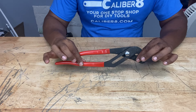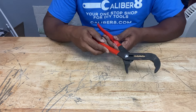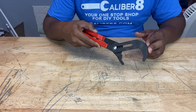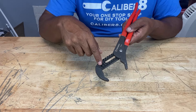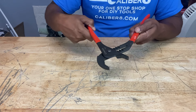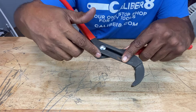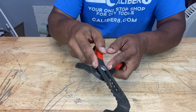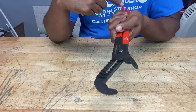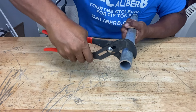This right here is definitely a must-have. They're known as slip joint pliers, tongue and groove pliers, but commonly known as channel locks. The jaw range is about three inches — that's one and a half times more than the crescent wrench. These are used a lot in the plumbing industry to grip onto pipes. There's a channel here and the arm slides up and down it. Upon closer examination, it has grooves on one side and a ridge on the other, so when you close it, the ridge slides into a groove, locking in place. The teeth allow it to grip onto materials like metal. Crescent wrenches don't have teeth.